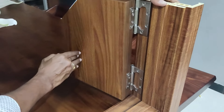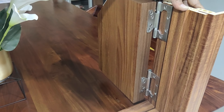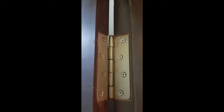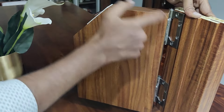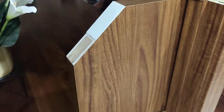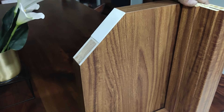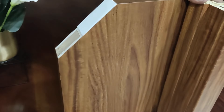Finally, I would like to show the hinges. As you can see, these are different — they are called butterfly hinges. Typically, many door manufacturers use butt hinges, where both sides have the same shape, so when you close the door both sides of the hinge come on top of each other. In a butterfly hinge, the section attached to the shutter, when closed, goes inside the section attached to the frame, taking less space. This means the gap between the frame and shutter is quite less, giving benefits such as better soundproofing, less light permeability, and better efficiency.